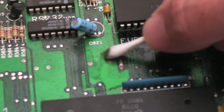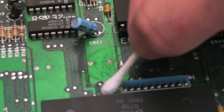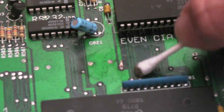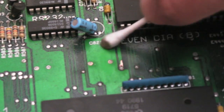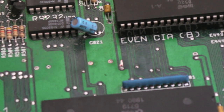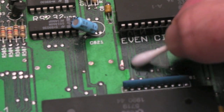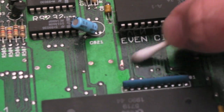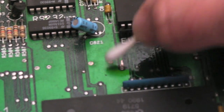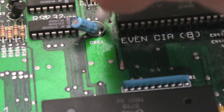If I just clean that up - look how dirty that is, it's really bad. Bear in mind there's going to be lots of little rust particles. I'll go over that with a toothbrush and some more IPA afterwards. But you can see we're back to bare metal there now and it's nice and tidy, no rust around those connections. There's really only that one trace that would be an issue - the others were just ground stitching straight through the ground plane, so they're not really that important.